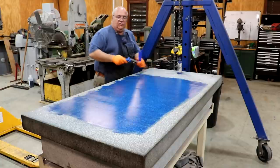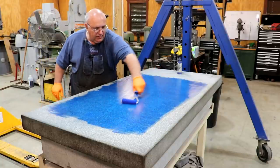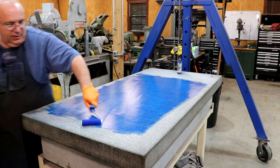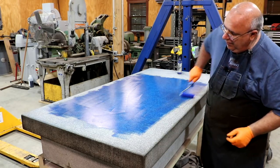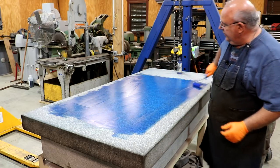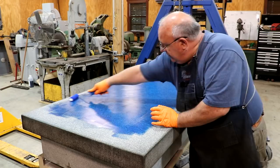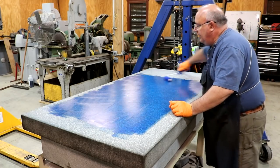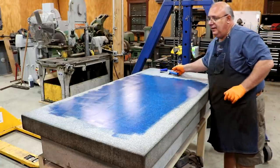What we're shooting for is to have a good area of contact all the way across the part. We don't want it to be a solid blue — we want individual points of contact. Depending on the part, the number of points per inch can vary somewhat. On a big part like this with a lot of surface area coming into contact, I'm not as worried about having 40 or 50 points of contact per inch. If I can have 10 to 20, that's really all I need because we have such a large area in constant contact. I've got this blue pretty well spread out — I can see the plate through it, which is kind of what I want.